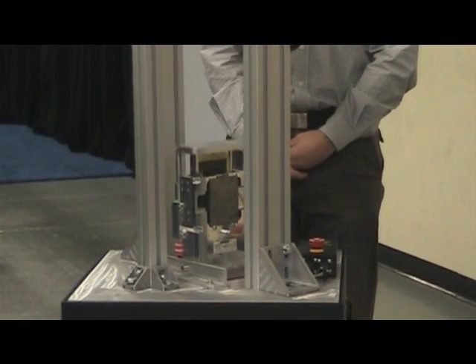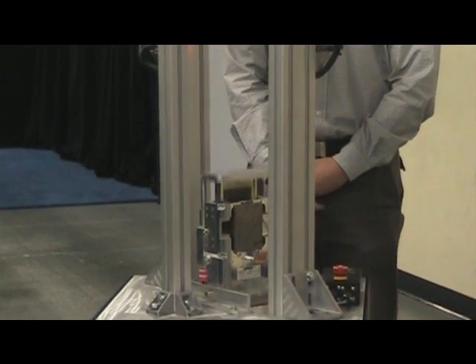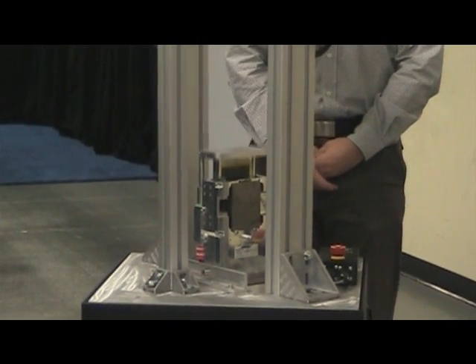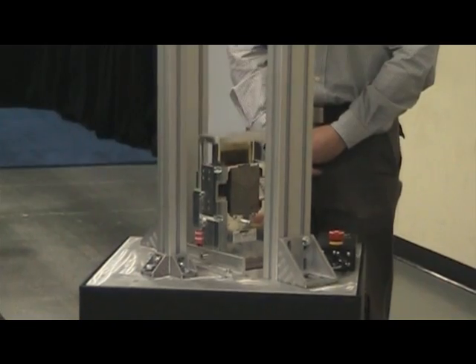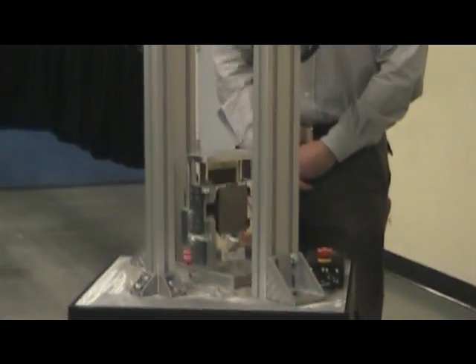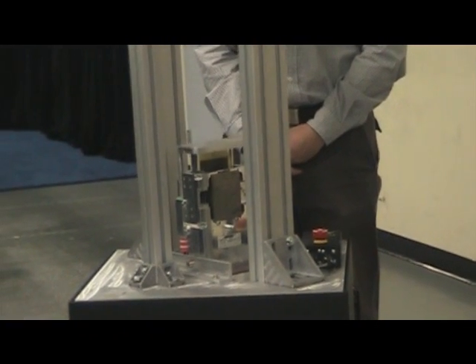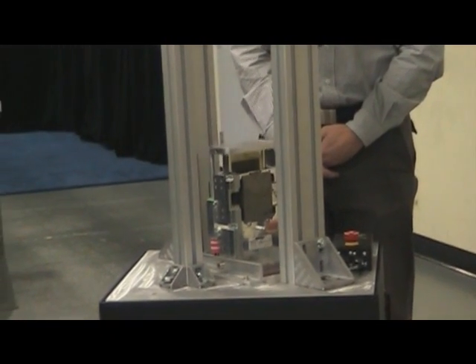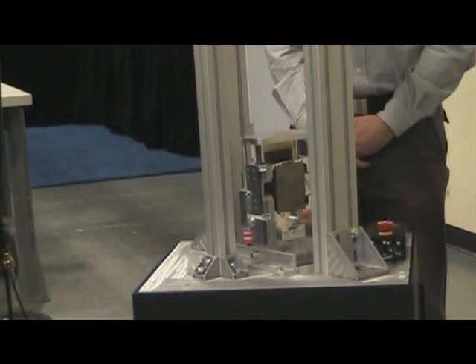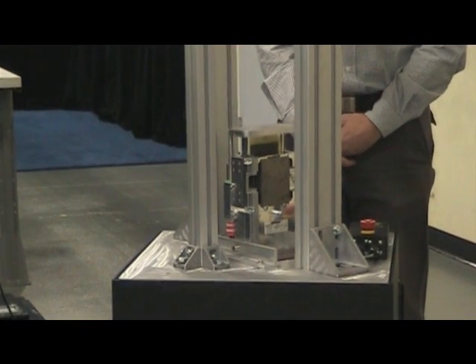1,001... 1,002 — that's two cycles per second, two hertz. Double it again — this was the belly frequency, remember four hertz? If you just think about sitting on that for a while, you should start to feel kind of awful, because this is really awful. But you can see from the chart, we're not very far up into the whole spectrum that affects drivers. When we looked into different technologies — pneumatics, hydraulics, and all sorts of things — we found they were too slow. In fact, a hydraulic system can only go about this fast in terms of canceling vibration, and that's not fast enough.